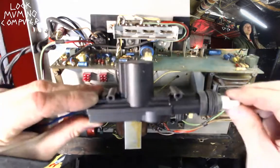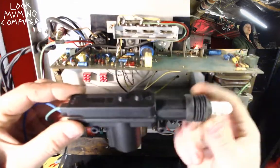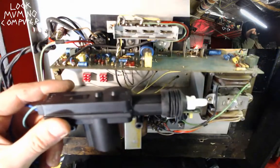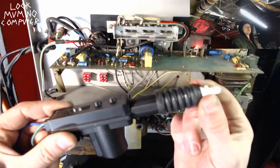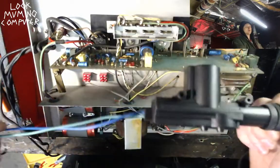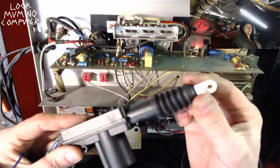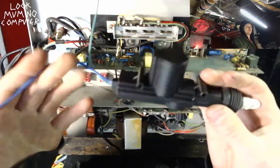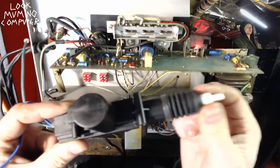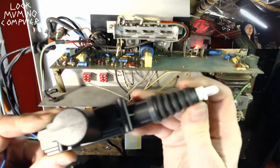This is quite funky. It's for a project for my girlfriend for her camera. Basically, it's going to push the shutter, because she needs it every photo, once every 5 minutes: the shutter has to be open for 5 minutes, shut, and then flick over to the next picture, open, shut. This is a central locking actuator from a car. It turns the central locking on and off. These are better than solenoids because they're really strong through the whole piece of travel. They've got the same amount of strength, whereas a solenoid needs a little bit of help going forwards.